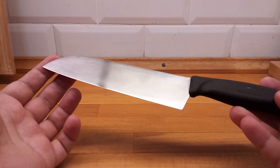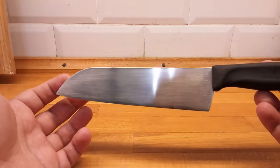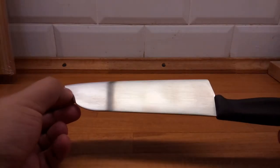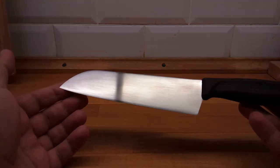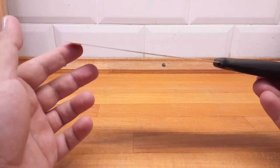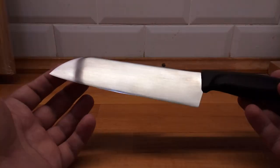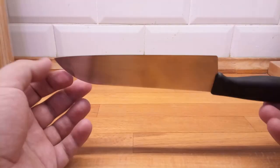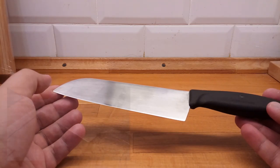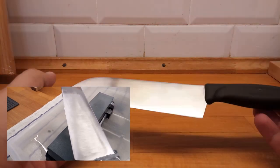This knife I have owned for 4 or 5 years now. Around 2.5-3 millimeters of the blade width have been reduced by sharpening and using the knife. And it was time to thin the blade to have a better slicer, to perform better in daily kitchen tasks. Very simple and very boring procedure. I will include a very short clip showing the bevels before thinning and during the procedure.